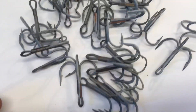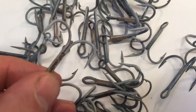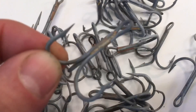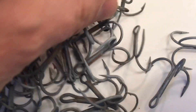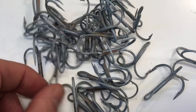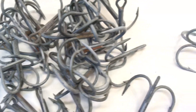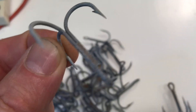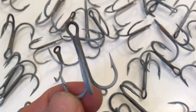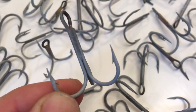And that's it. When you've plated all your hooks, they're going to look something like this. The coverage depends a little bit on how well you were able to clean your hooks before you started the plating, but now they're all covered. You can actually load in five or six hooks at a time in your little reactor, so that goes pretty fast. And now it's just a little bit of polishing left. I'm going to give them a minute each on the polishing wheel. This zinc plating is very strongly attached to the surface of the hooks.